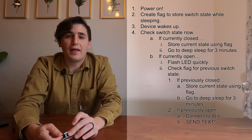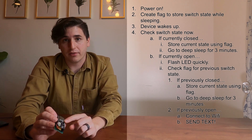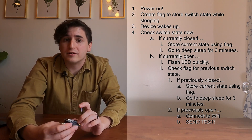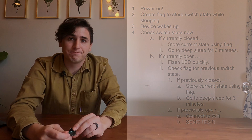For alerts, I'm using a service called If This Then That, or IFTTT, which is a really awesome way to hook up generic web requests to services that you probably already use. You can configure it to send a text message, send an email, turn on your smart lights — there are so many options. The cool thing is you don't have to change the code running on here to change the behavior; you can just use their app or their website. Highly recommend it if you've never used it before. And that's really all there is to it. I spent $12 and maybe two hours getting it all to work, and after running it for a while, it appears the battery life is a little more than three weeks, which I'm totally happy with. I could always extend it with a bigger battery or by making the sleep interval longer, but I don't think that's worth the effort. Admittedly, I have not gotten any real alerts yet, but we haven't had any meltdowns either, so jury's still out on whether any of this was worth it.